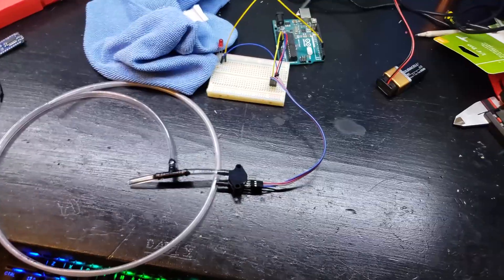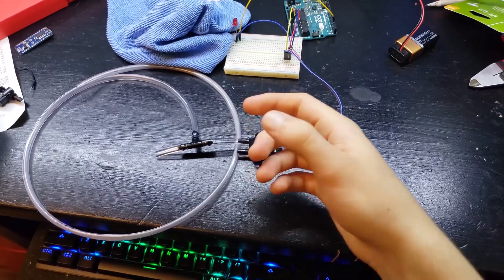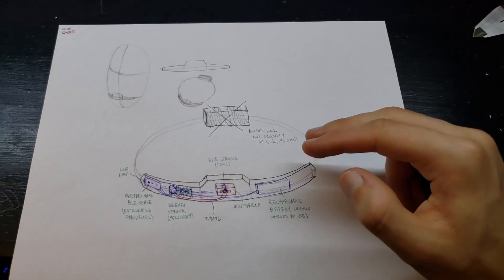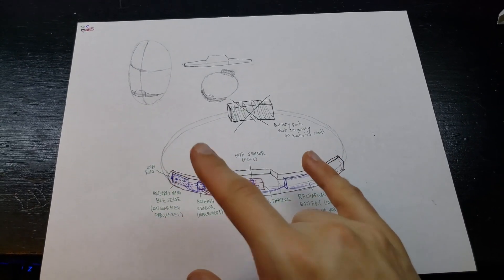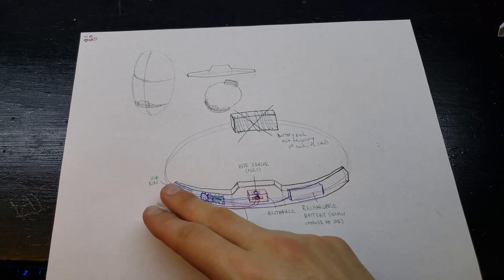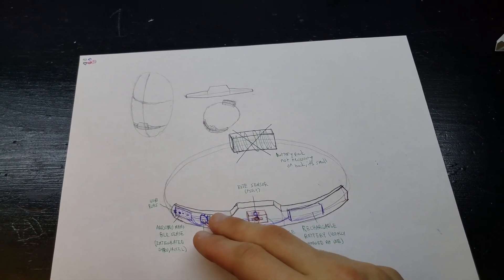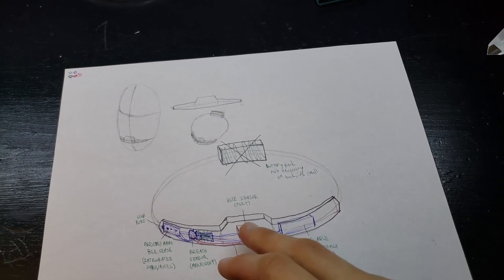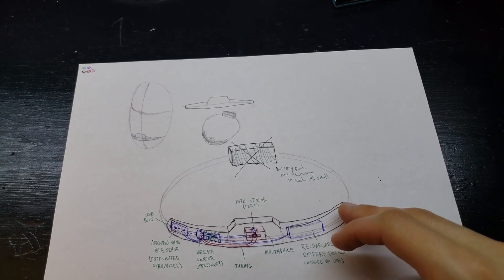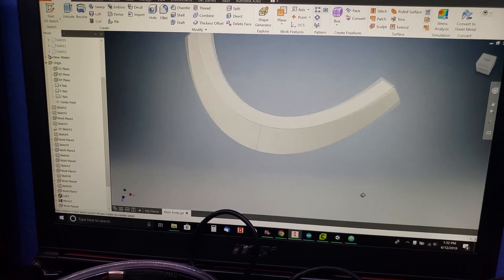Now the issue is fitting all of this into a tiny headset that can go on my mouth. I've actually started some designs. This is my basic idea that I jotted down at like 3 in the morning — it's just going to be like a bar. We'll have the Arduino on one side with the USB sticking out, the mouthpiece protruding out, the pressure sensor somewhere around here, battery over here, and the exhaust tube going around to the condensation collector on this side.